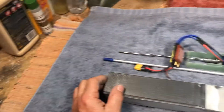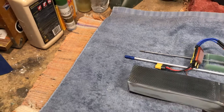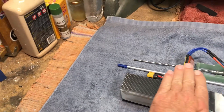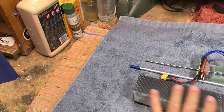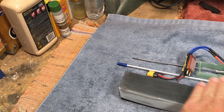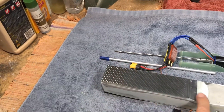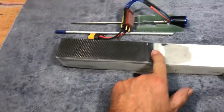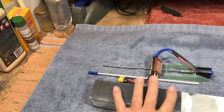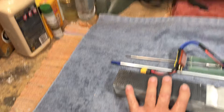So what I did — actually I did it a couple of times. The first time I built up the old ski with epoxy and cabosil, then put a layer of 0.3 millimeter carbon fiber over it and sanded that all out. In fact, there's a little bit of it you can see right here that's left. That added far too much weight and too much complexity.